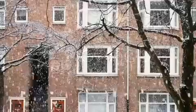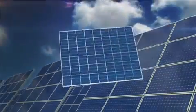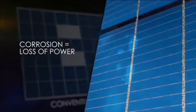In the real world, solar panels have to stand up to moisture and humidity — rain, snow, fog, wet summer heat, again and again, year after year. Humidity can be a big problem, because when moisture penetrates solar panels, it corrodes the internal metal components. It can also react with the silicon in the cells, further reducing power output.